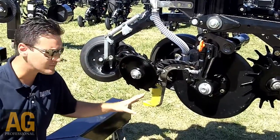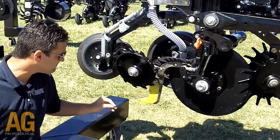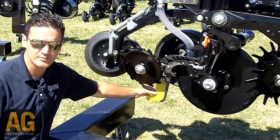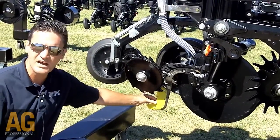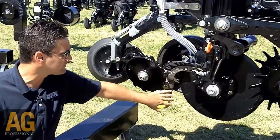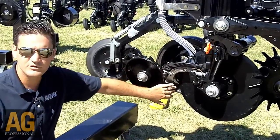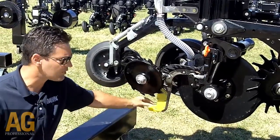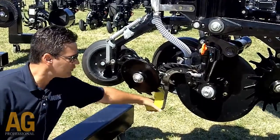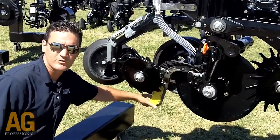With low-pressure liquid systems, that's the direction you would go. The plastic diffuser is a low-cost wear component that can be replaced for about $5. The knife assembly has a replacement cost of $18 and will be changed at around 300 acres per row. The plastic component will be replaced at around 150 acres per row. The whole device is spring-loaded, so it can trip over rocks.